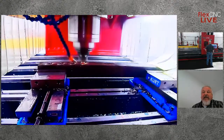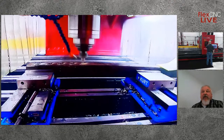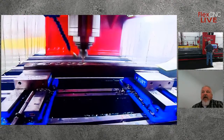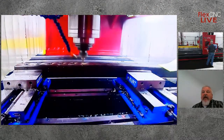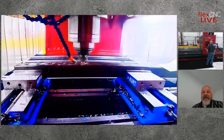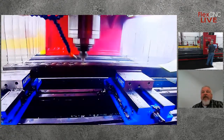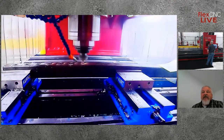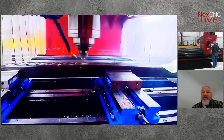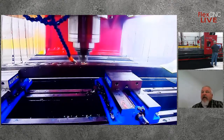To utilize the FlexCNC, we're seeing a lot of our customers in the handrail industry and the manifold industry are the 2 big ones that can really take advantage of the FlexCNC machines. And that's due to the length. I mean, they can provide you with any length that you need. And instead of using a standard machining center, having to shuttle the part 2 or 3 times, you've got one setup here with the FlexCNC, and you're finished. There's less chance for errors, less setup time, and less process time total. So it works very well in that regard.